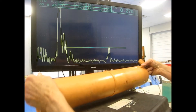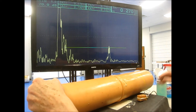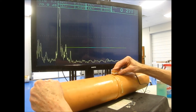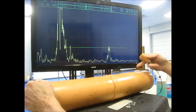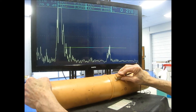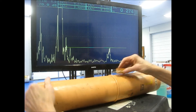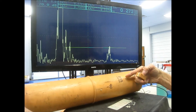Here's the piece of HDPE. I'll start out by showing what a good fusion butt joint looks like. This is an area that's unflawed — can't find anything. Where this yellow line starts, there's a flaw. As I come around — boom, there it is — and I can follow that flaw around quite a ways until it stops at the yellow line over here.